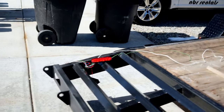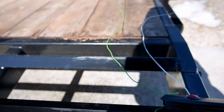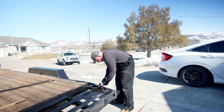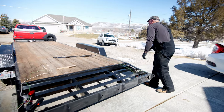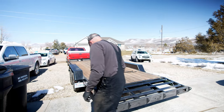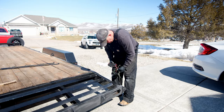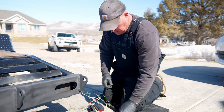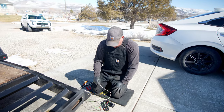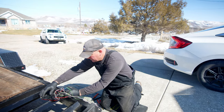This one's blinking, this one is not — that one may be wired to this one. It may come this way and go over that way, because this red wire is unhooked and it's not plugged in. We probably need to rewire this. Basically we've got power coming down this side of the trailer and it's supposed to loop over to that side. What have I done — made a giant mess. Should have maybe paid some attention when I took it apart. We need to ground this too, but before we do that we've got to paint it. Let's flip these over so they don't get paint on them.